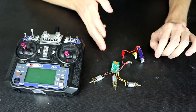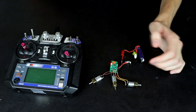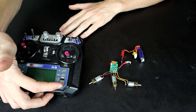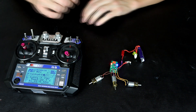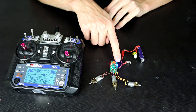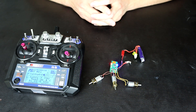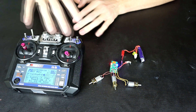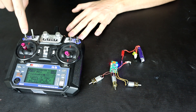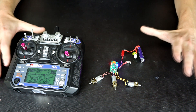To get into configuration mode you turn everything off, then turn the receiver on, wait for five seconds, and you'll see when we turn the transmitter on we're getting a flickering on our LED which indicates that we are inside configuration mode. At this point don't touch any of your sticks — what you want to do is go up to this switch and flick it back and forth the number of times shown in that little table I put on screen.